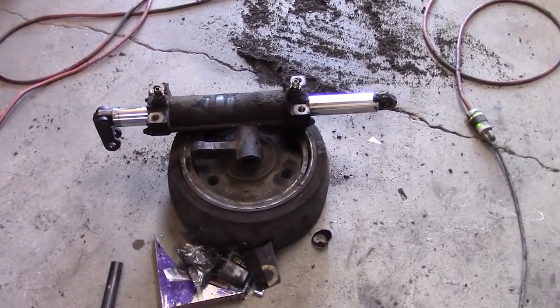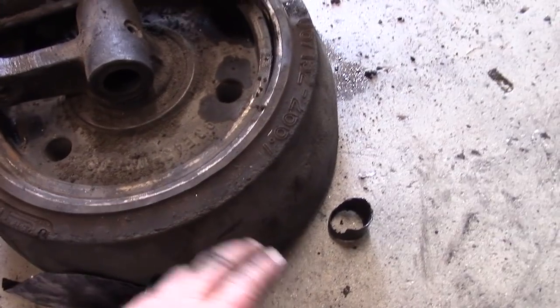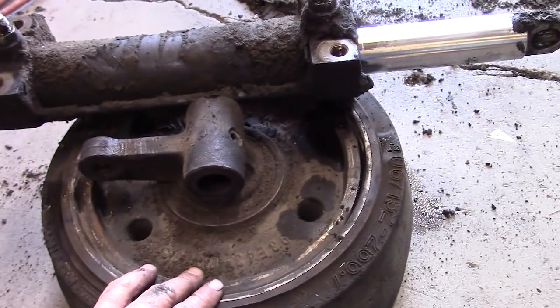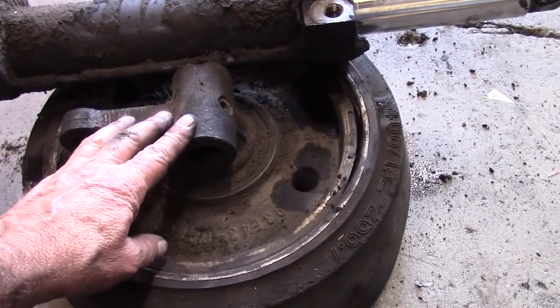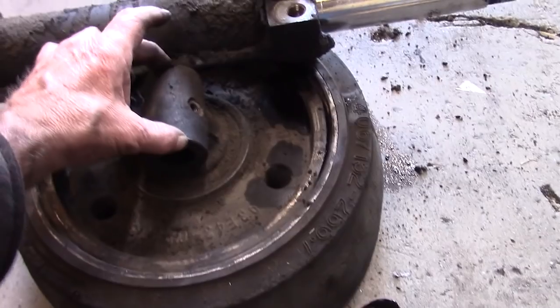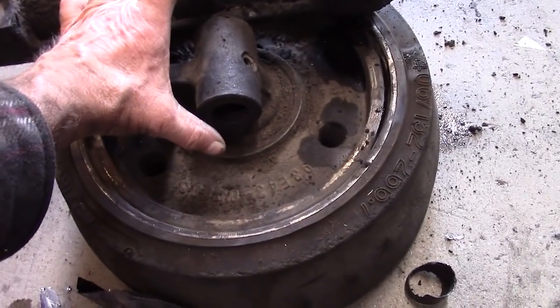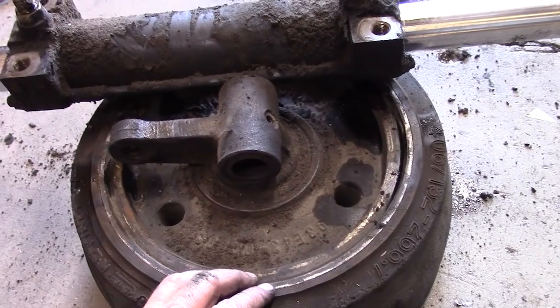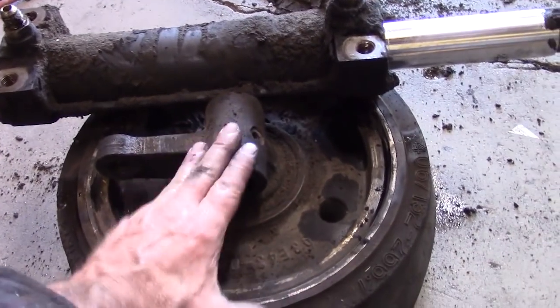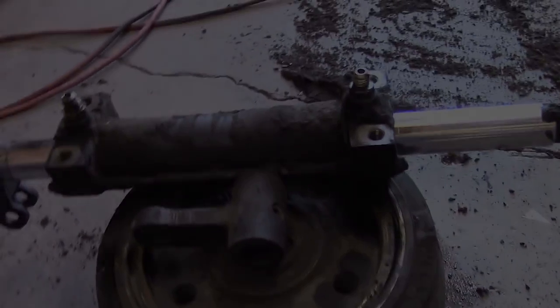That's our hydraulics for the wheels, and you can tell that we had a real issue with our wheel here, because you can see how it's narrow here and it's thicker here on this side, so we were getting really bad wear, and that was due to those bearings going out. Now, fortunately, this part here is bolted to the kingpin so that there is no friction inside this part here. So there's no wear in this part whatsoever. All the wear is on the bearings on either side of that and the thrust bearing that sits on top. So there's no issue of wear on this part whatsoever. So this is good. This is fine. And the dimensions on the ID are fine. So we're good there.